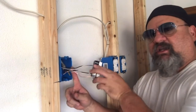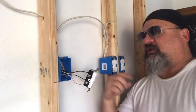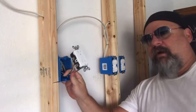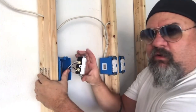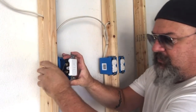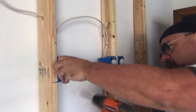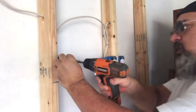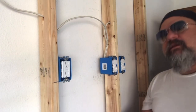If you watch some of my other videos on how to wire plugs and switches, I talk about the six inches of free conductor — that's wire from the edge of the box out to the plug. You don't want too much of it; it's just hard to push all the wires in. I put a little fold in here — fold down, fold up. I have my thumb on my ground; I push the ground in first, I want that one all the way in the back. I use my thumb to push all the wires in first, then push the receptacle in and line up my screw. Get my little screw gun and I'm done — fast, quick, neat.